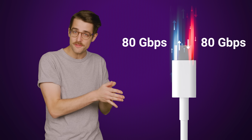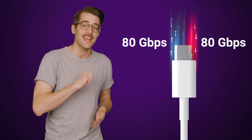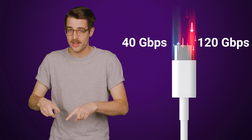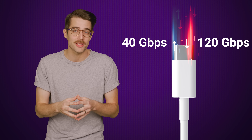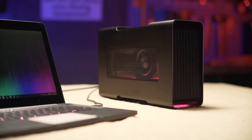As displays that offer high resolutions and HDR become more common, along with content and games that can take advantage of them, this latest USB revision could get us closer to a one-cable-for-everything future, instead of having to use separate HDMI and DisplayPort connectors. Even more impressive, instead of running in the default mode which provides 80 gigabits upstream and 80 downstream, you can instead run 120 down and 40 up, which could allow even higher resolutions and refresh rates. USB 4 version 2 also carries DisplayPort 2.0 signals and continues to support PCI Express and Thunderbolt — that's how it can support an external GPU.